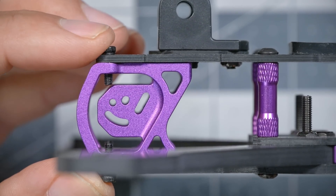One note about the front end: the screws you see here are not correct — there was a mistake in the manufacturing of this prototype. These are M2.5 screws; they're M3 screws in the final frame, and you can see how they stick through too far. I just had to grab some M2.5 screws I had sitting around my shop to hold this together, but I didn't want to wait for the final production unit to make this video.